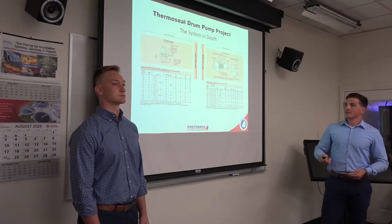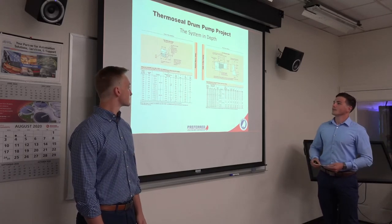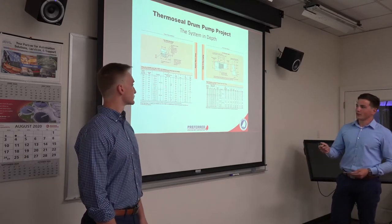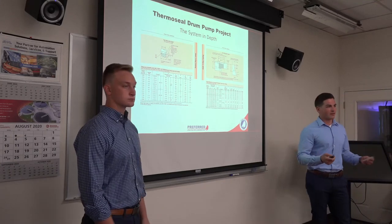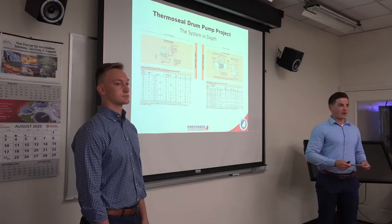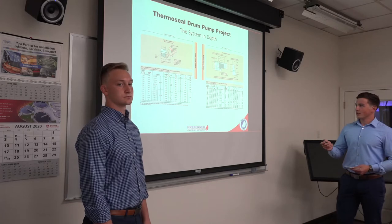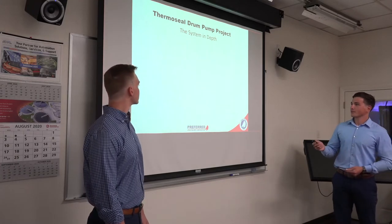So this is a screenshot of a page in the Parker Handbook. As you can see, everything for O-ring boss seals is specified, whether it be the thread type or the chamfer that goes on the end of the thread, like the fillets. Everything is specified. In our design, as I pointed out before, there were four that were non-standardized. I want to point out this F dimension up here, and also this D dimension, because those will come in handy in the next slide.